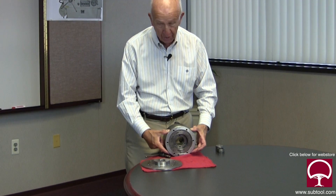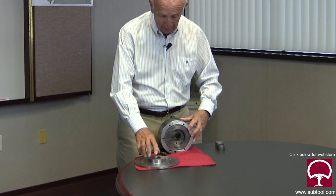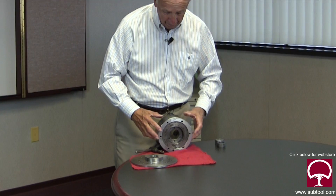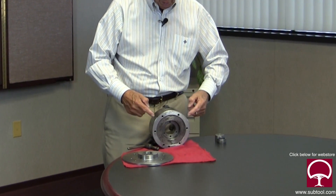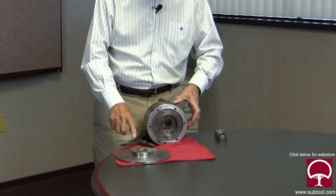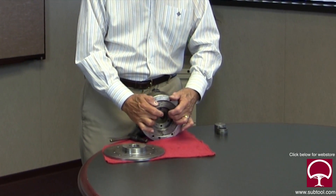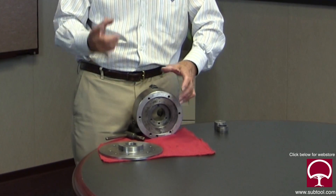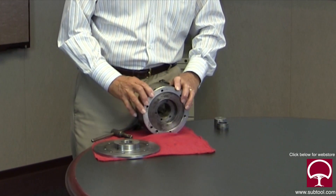In this case there are four screws — some of them only have three because his patents have run out, by the way. That bolts onto the adapter under the faceplate, and you leave the fixing bolts loose. Then you can use these set screws to true it up because there's about 20 thousandths difference between this OD and this ID, giving you the ability to move it around. Very clever idea.